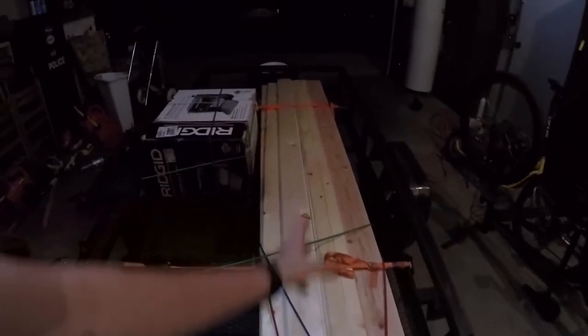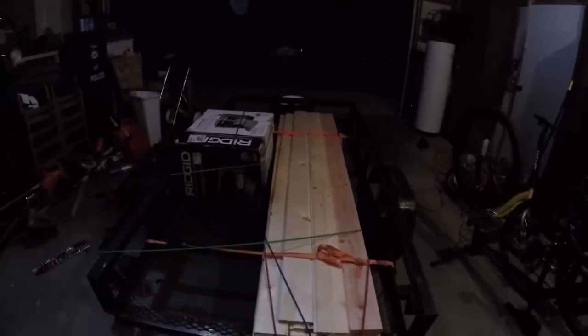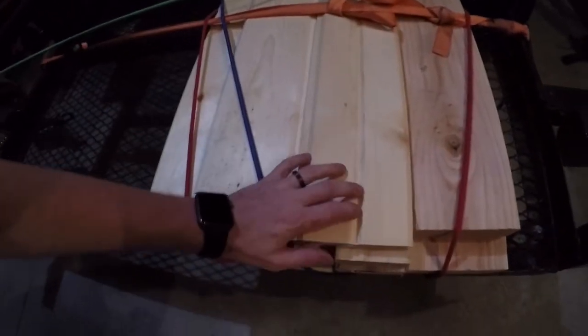We had to run a few more errands after Home Depot, and as you can tell it is dark outside. So I'm just going to give you an overview of what we bought, and then Tuesday we will actually get to building this thing. Basically, I'm going to build the outside frame — the two side pieces that go all the way up the door — out of these two by sixes. The top and bottom parts of the door are going to be two by fours, and then there's going to be a two by six right up the middle. These wainscoting boards are going to be at the diagonals all the way up in between the panels.